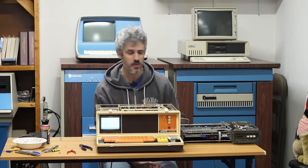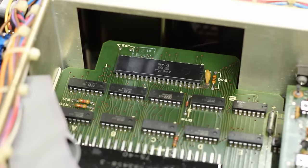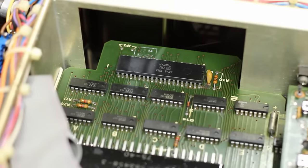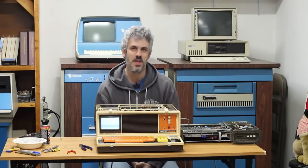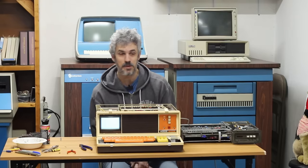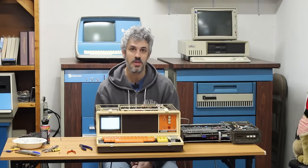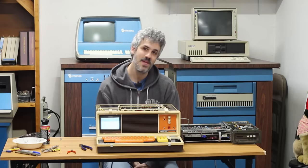But the fact that when the PDP 1123 sometimes boots, it sometimes spews parentheses onto the screen, tells me that the UART is mostly working. As a matter of fact, tells me that a lot of this is working, but a lot of it also isn't working, because in full duplex, whatever we type should echo back onto the screen. That doesn't happen. If I have pin 2 and 3 jumpered on the connector, we should definitely be getting echoes back onto the screen. That's not happening. So we've got failures somewhere.